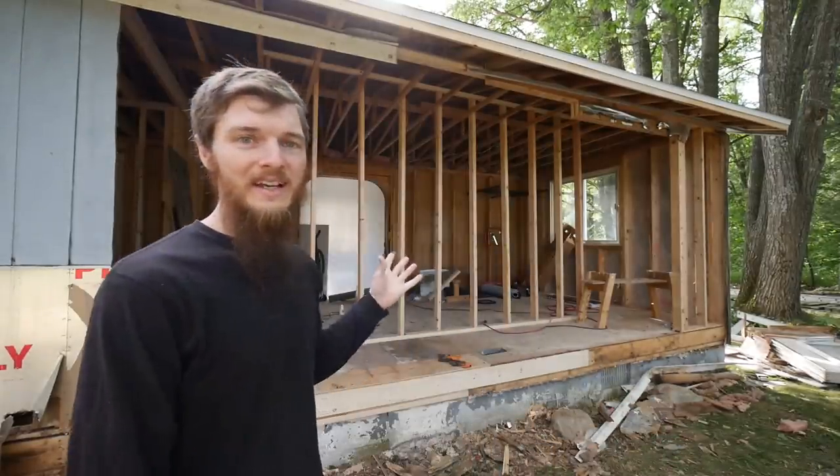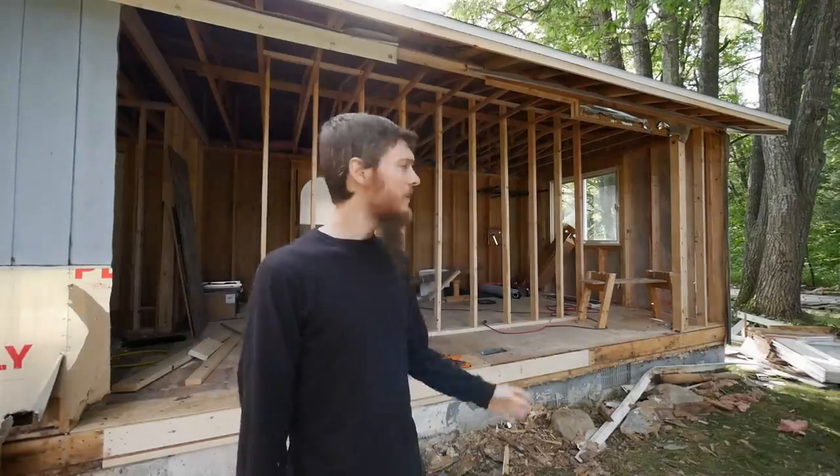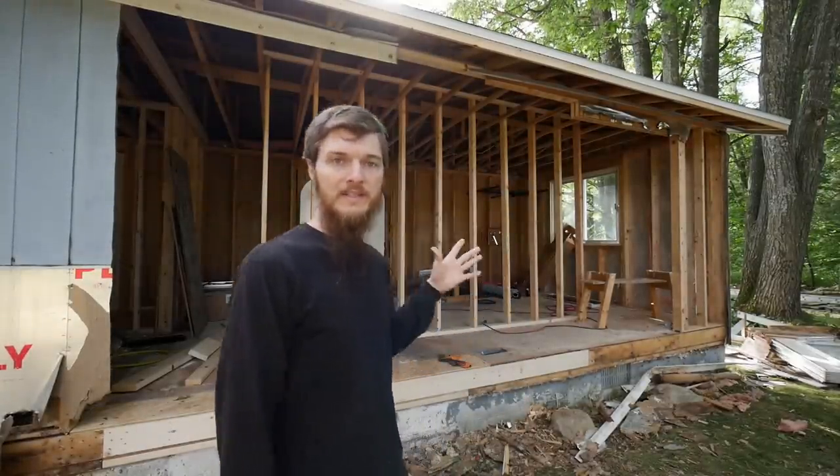We are in the middle of a home renovation, and as you can see, it's getting a little bit carried away. We had to replace this whole wall because it was rotted out all under here. The sill, the roof line, top plate, everything was rotted. So we had to remove the front door and the window and the whole wall. The goal today is to try to get this wall rebuilt and sealed in.